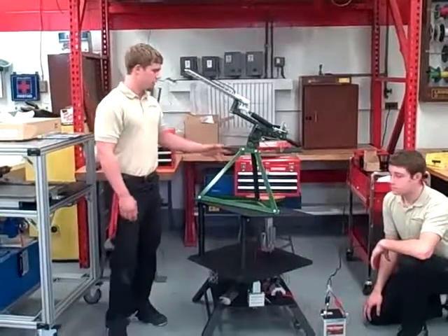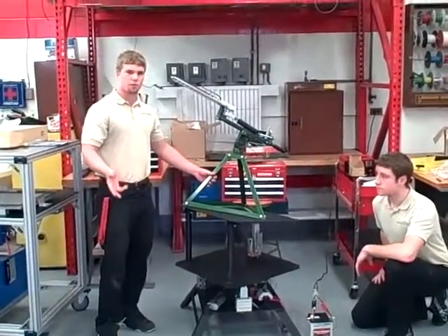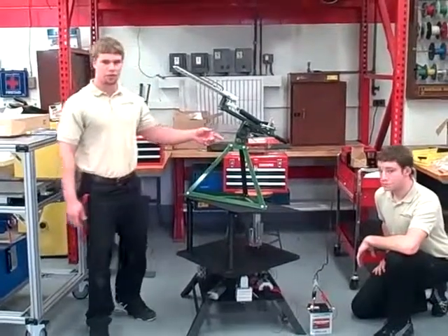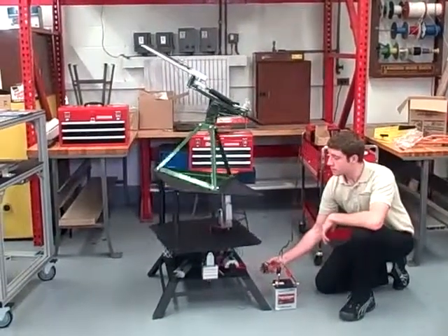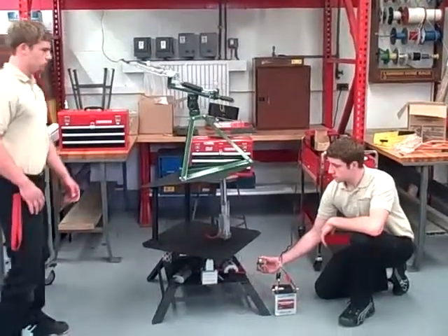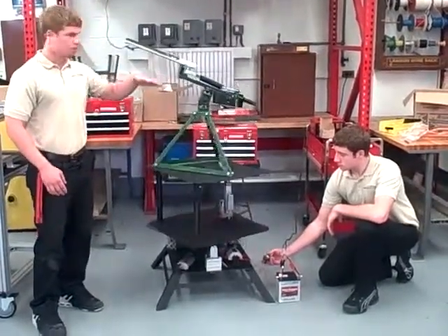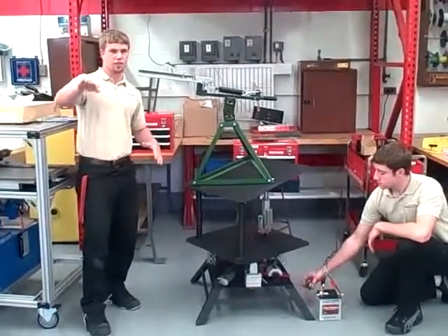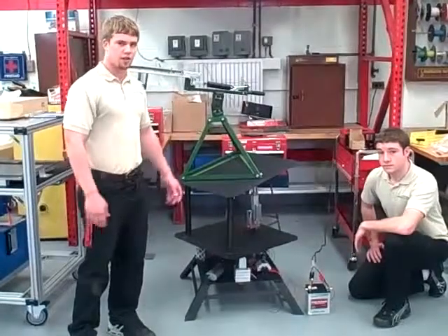And now we're here to demonstrate how it works. Right now we just have a hand thrower on there, which was made for us by Ben's backup. It's really designed for an automatic clay thrower, so basically one of the buttons would be pushed to control the tilt and the other one just to throw it. So therefore it's fully automated and it'll throw in different patterns for you. Each time you hit the button, it'll fire a counter and switch positions. We have four different positions right now. As you can see as it's doing this, you can throw in different flight patterns — whether you want it up high and more leveled out, or if you mount this in another direction, it'll actually wing the clay out or in.